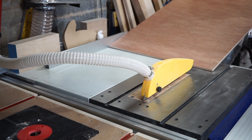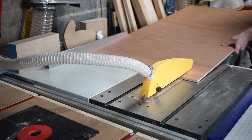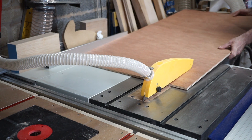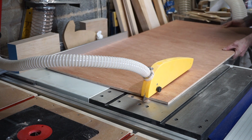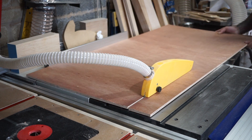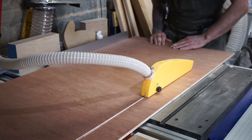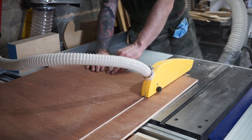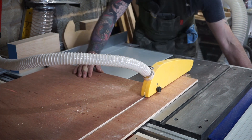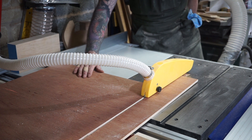After test fitting the joints, I cut grooves for the side and back panels in all of the legs and stretchers, though I did this off camera. Once the grooves are cut, I then rip and cross cut the panels to length and width at the table saw, and as the work is now thinner, the guard is back in place. Again off camera, I apply stain to the plywood panels, and all of the legs and stretchers get a good coating of boiled linseed oil, as I won't be able to flip the bench once everything is assembled.